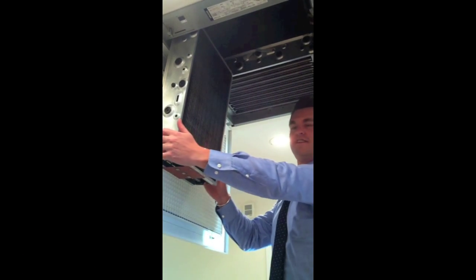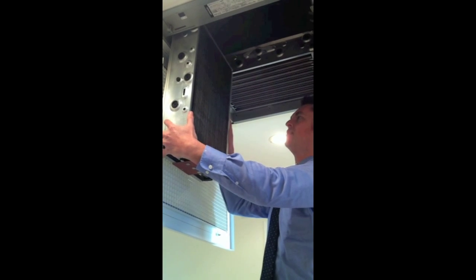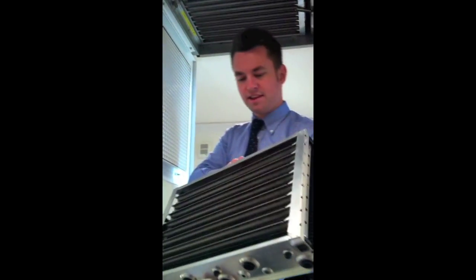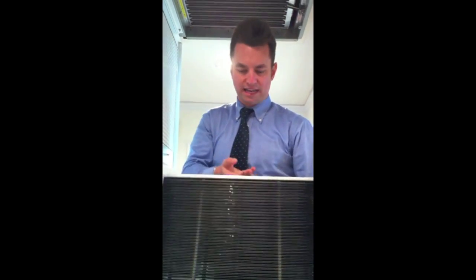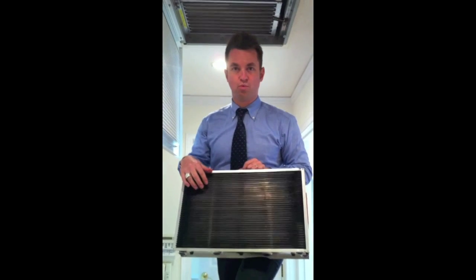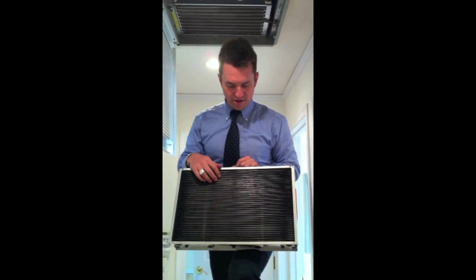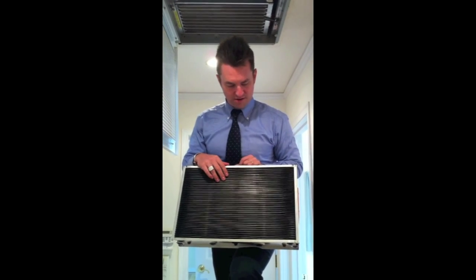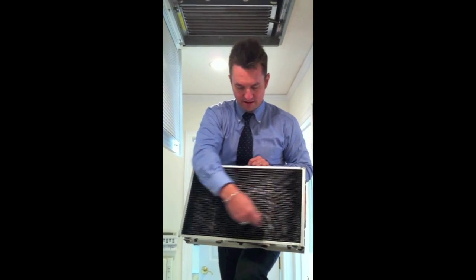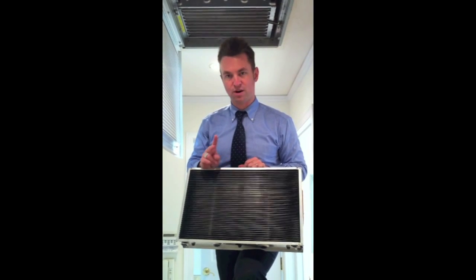Step five is to take the cell off. Just lift — there's a handle here. You can hold the handle, just take it off the hook, like this. This cell needs to be cleaned at least twice a year. You should use water — you can clean it with a hose outside, or maybe in the shower. You need to clean it with water or a vacuum, right inside the cell, inside the filter, so that it's all clean. Do that at least twice a year.